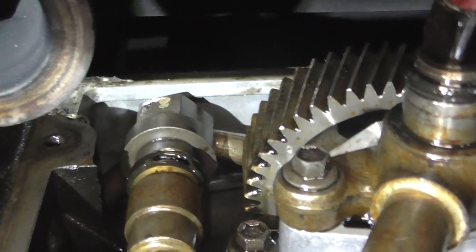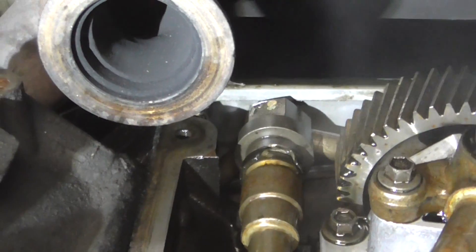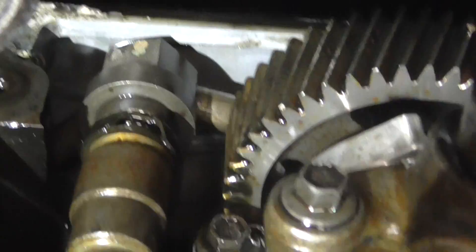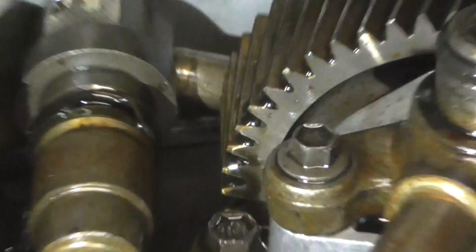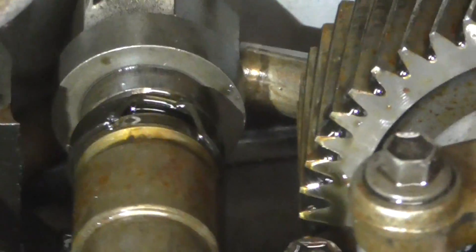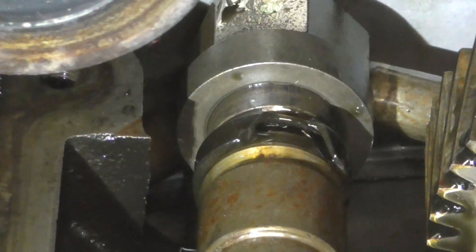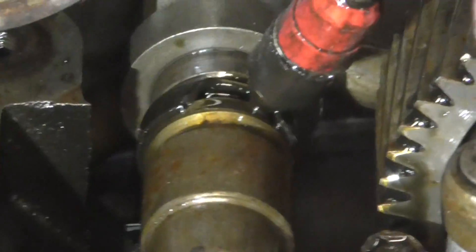I'm not sure how well you can see that, but right there on that fitting — I'm probably getting oil all over my hands doing this — you can see that bubbling action going on there by that quick connect fitting. It looks like somebody had actually replaced this pump not too long ago, but we definitely have a leak there by our quick connect fitting, and it looks like they even broke part of the quick connect collar off.